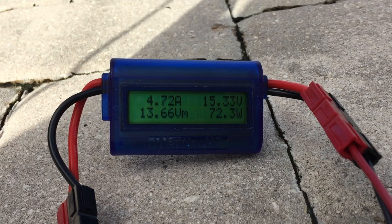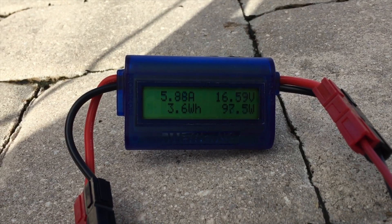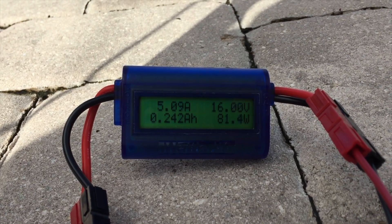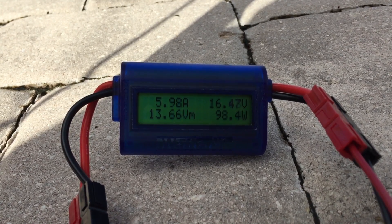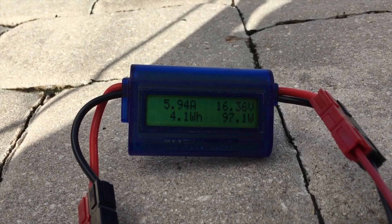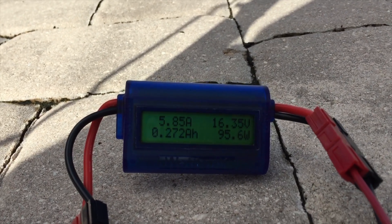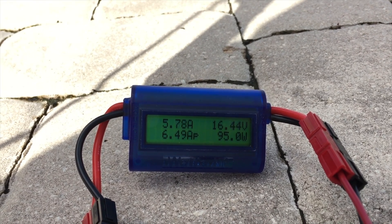What I've been most impressed with on this panel is that we actually do hit 100-watt output, which is fantastic. You're watching it on the load side — the battery pulled in 100 watts. I'm getting a little haze right now in this segment, but when full sun comes back out it's back up again. This is not something I've typically seen with panels; they tend to be 20% less than their rating, sometimes 30-40% with really cheap panels. Very happy maintaining about 96 watts — I'll take that output, especially in a portable unit like this.